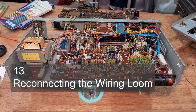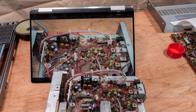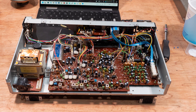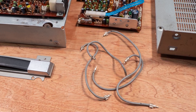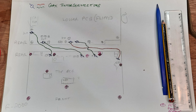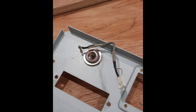I appreciated help with rejoining the sub-panel to the chassis — feeding 17 display wires through the bracket on the PCB, then gradually moving the two chassis parts together while ensuring the wiring loom connectors moved above or below the chassis as appropriate. The wires made everything a bit springy but once we started fitting the four screws everything joined together happily. The comprehensive collection of pictures taken earlier helped tremendously with reconnection, displayed on my laptop while plugging everything back into the boards.